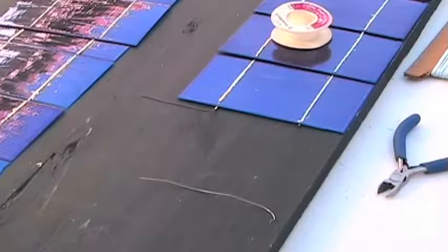This configuration is kind of a long skinny one because I happened to find some glass and some wood, both just found on the street. The glass is tempered glass — some glass shelves that someone discarded — and this wood is solid wood, not plywood, and it was already painted. I need to have two 9-volt arrays connected together to make 18 volts total in order to charge a battery pretty well.